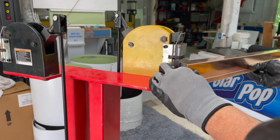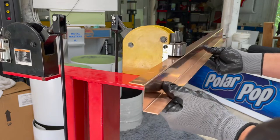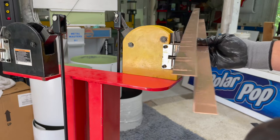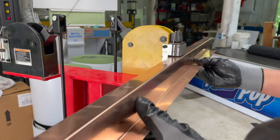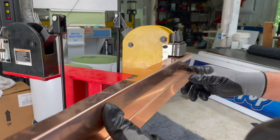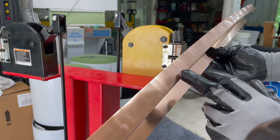Let's give it a shot — start out right here on the end. Just tap it a couple three times and go every three or four inches to get it started. As you can see, it's already starting to stretch. I eyeball about a few inches as I go. You can see it's stretching a little bit, but it's getting warped because of built-up pressure, so we're going to flip it around and go to the shrinking side.